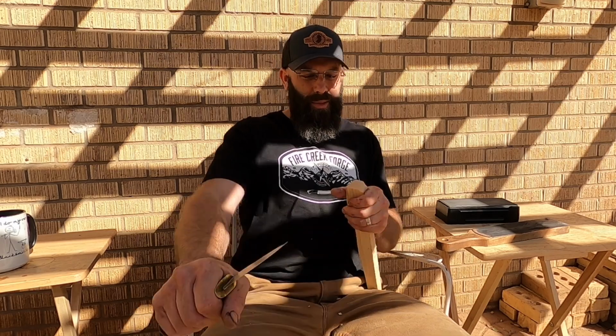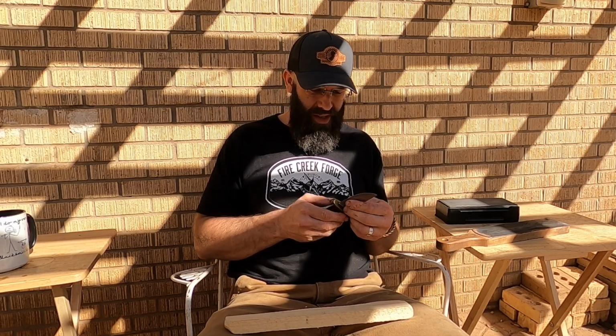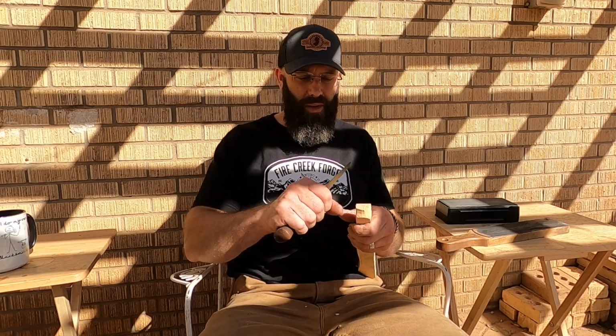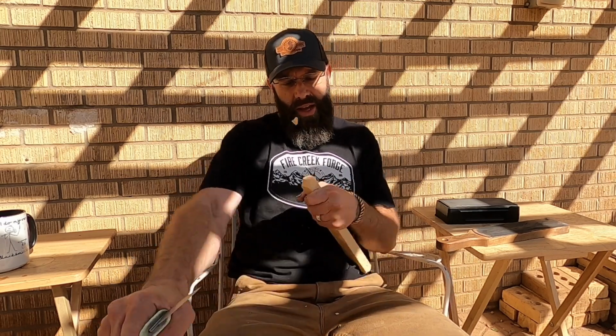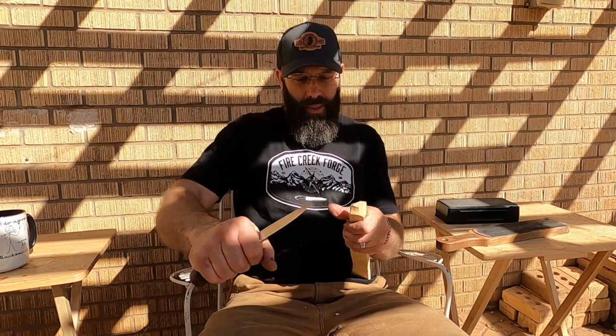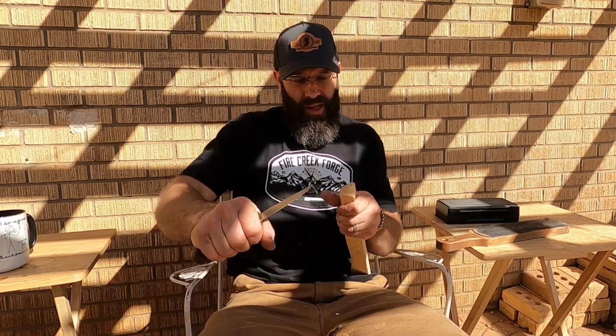So I'm just rambling as I'm carving on this, but the point I'm trying to make is, I got a little scared there. I'm feeling a little less scared now. After this second sharpening, I'm feeling pretty good about the fact that it's probably just a layer of decarb on this blade, especially this blade being forged as we did. So I'm cautiously optimistic that that's all it was.